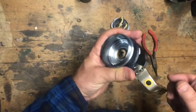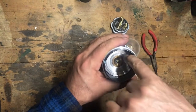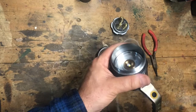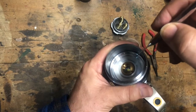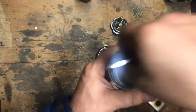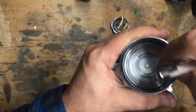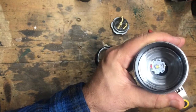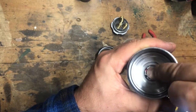Down here underneath, it's really hard because I keep getting reflections off the light shining straight back into the camera, because this backing is machined and the little ridges shine at almost any angle. Down in here there's a locking ring which just turns out. Underneath, you can see there's a white cover, and underneath that cover is just a standard star-style LED. As I mentioned before, it couples onto a little ridge down there, so it is getting reasonably good heat sinking.